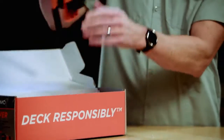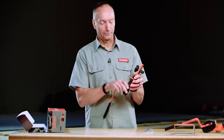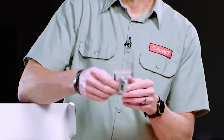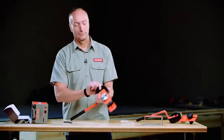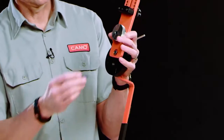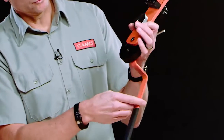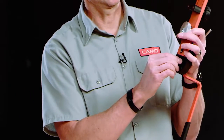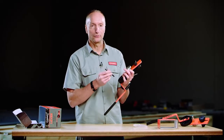Pull your tool out of the box — just a real easy setup before you can begin to do work with the Camo lever. Inside this bag there's an Allen wrench and a bolt. Take those out. On the bottom of the cam of the tool there's a little hole — that's where the bolt goes. You're gonna align that hole with a hole on the handle just to lock it in place, screw that into position, and then tighten it down with your Allen wrench.